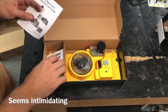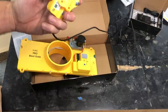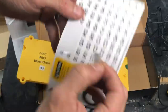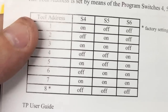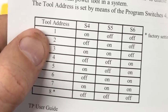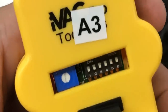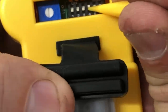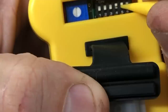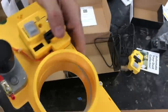When I opened this up it seemed pretty intimidating, but once I got through the instructions it made a lot of sense. You need a tool sensor for every blast gate. I'm labeling this one A3 — basically telling it this is Tool 3 — and then I label the corresponding blast gate A3 as well. You get into the book, open that little door, and put in the corresponding DIP switch code for Tool 3. I moved up switches 4 and 5 for that one. You can actually use one tool sensor for dual blast gates — my bandsaw has two ports, so I have two blast gates on one tool sensor.